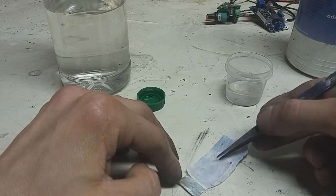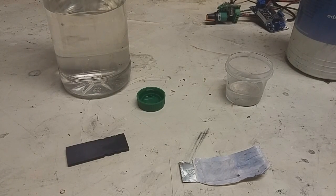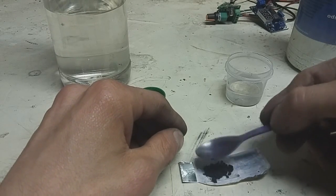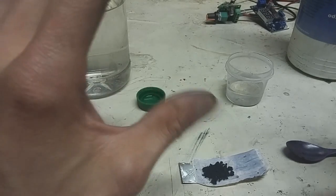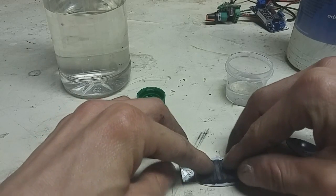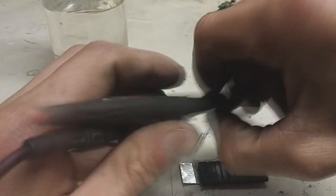You add vinegar electrolyte on the polymer separator. Now what you need is the active material — this active material is activated carbon. To increase the voltage you can also add just a little manganese dioxide, but activated carbon alone will be fine. I will now measure the voltage.